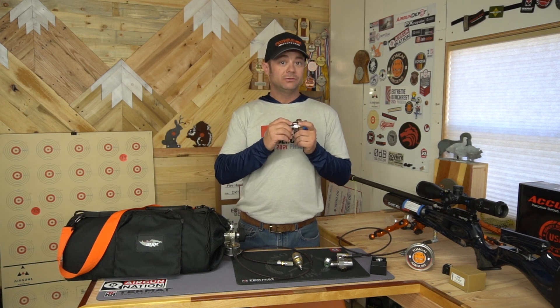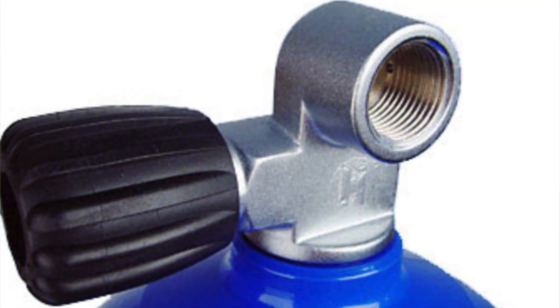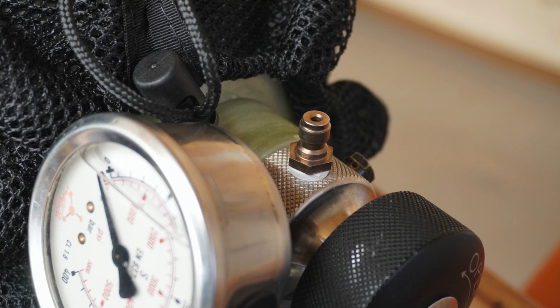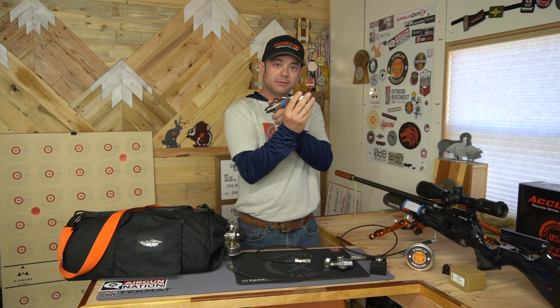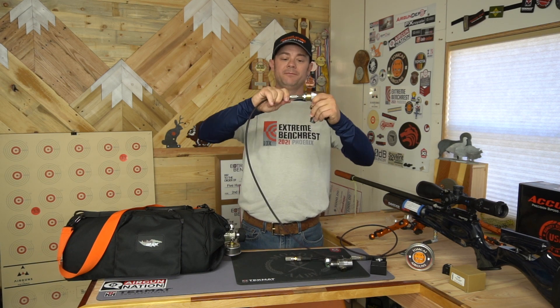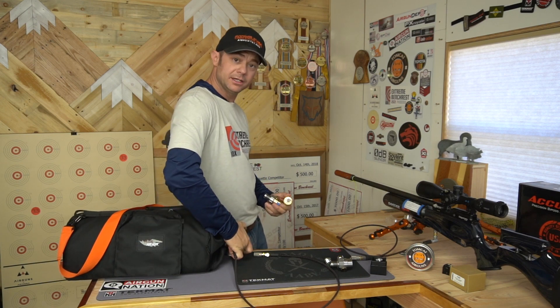This is an inline Huma regulator, and with me I've got it truly in line. This is a DIN fitting — you'll find those on scuba tanks and a lot of airgun filling bottles. This is the Omega Patriot, and it's got a foster fitting as a discharge. I wasn't really about to take this all the way down to a 1/8 BSPP fitting and screw it in here, because that's a lot of strain on those tiny threads. I could put a female fitting on the end of this, but again, that's a lot of potential strain. So I decided to stick with the line — really put it in line, with a hose on either side.